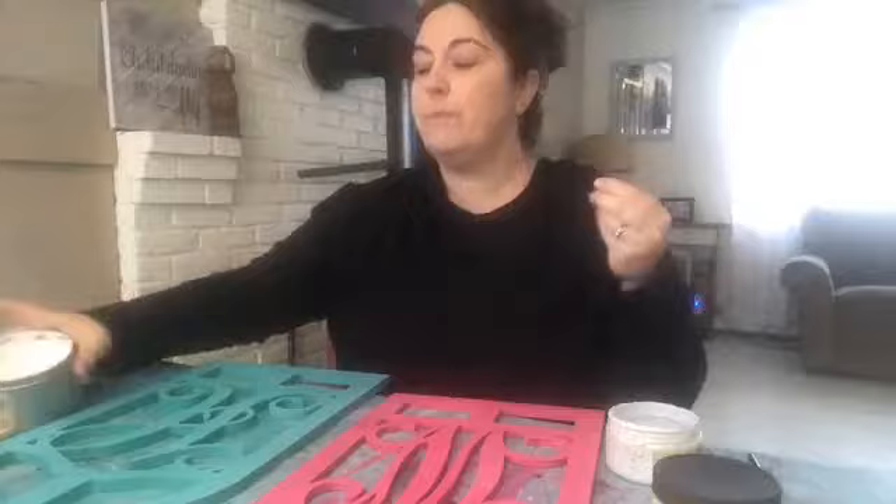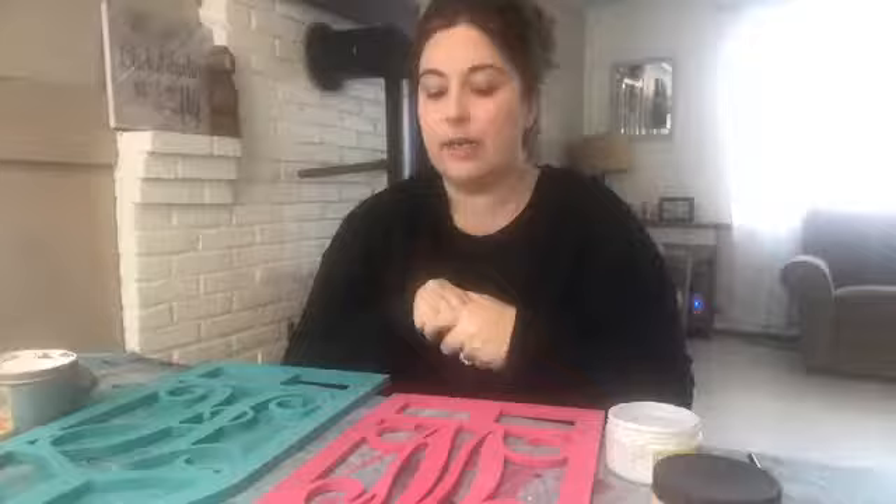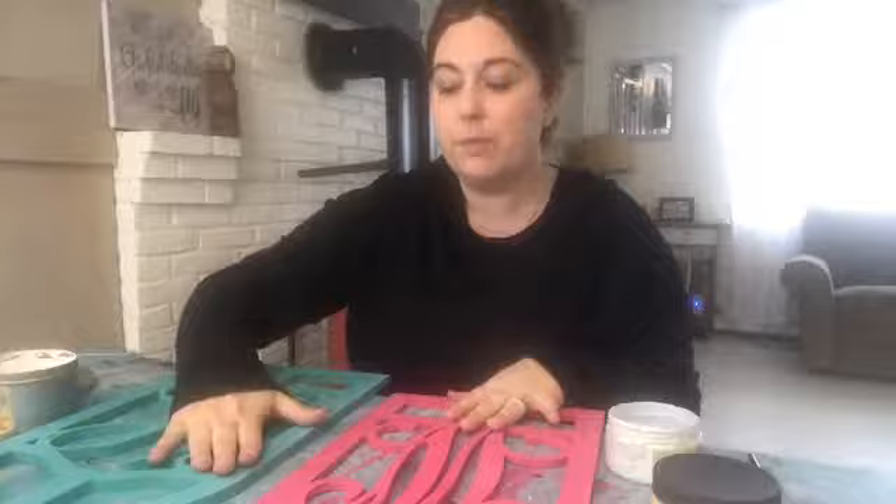With a product like this you're going to have a little bit more control. So if I were doing a big project like a piece of furniture or kitchen cabinets, I would want to clear coat over my paint before I start glazing and waxing, because that will give me more freedom to wipe off where I might not like where it goes or to add more in spots. It doesn't go on quite as heavy when you have a clear coat base — when you go directly over the paint, it's more chalky and porous so it's going to absorb more of the product.